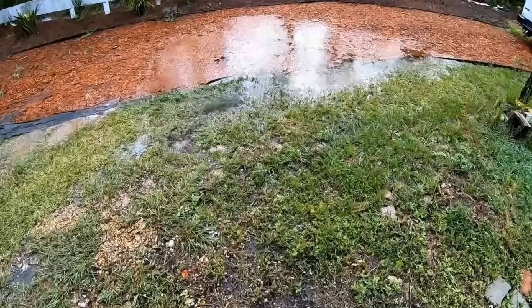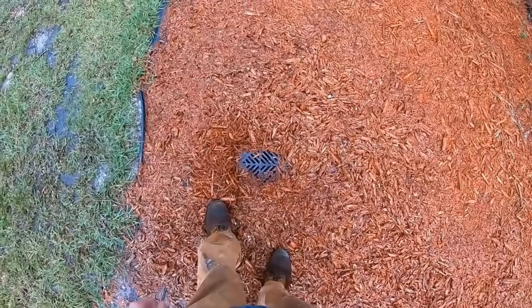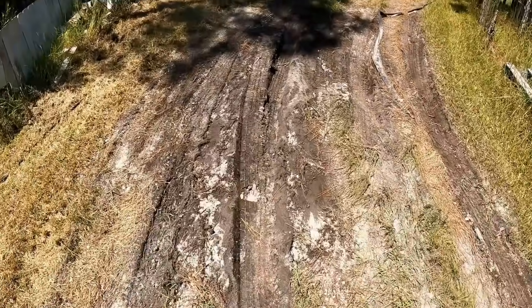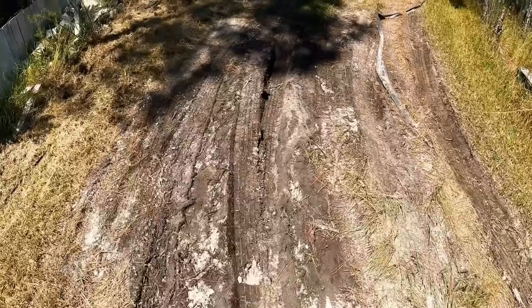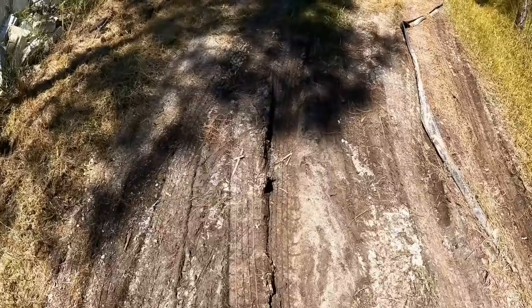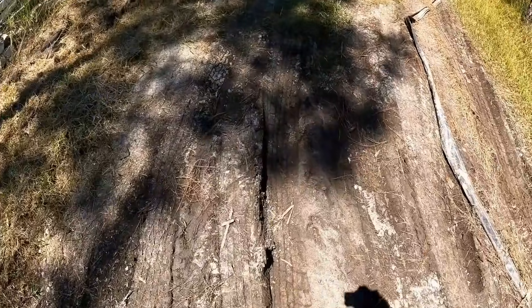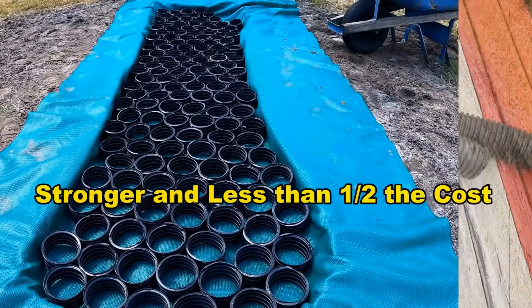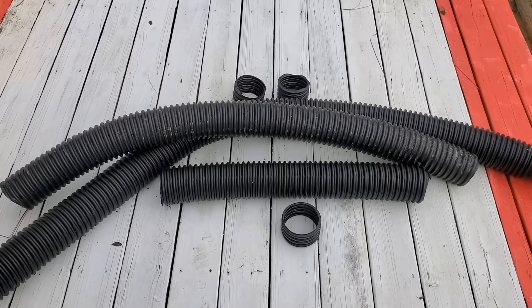A few years ago I had the driveway covered with mulch, and although there's a French drain and a catch basin here, it didn't make any difference. I can move the water, but the underground water is the problem. I've tried everything — gravel, mulch, more dirt. The gravel worked for a little while, but it sinks down and moves sideways. It's very hard to keep stable soil here in Florida, so we're going to try the homemade geo grid.